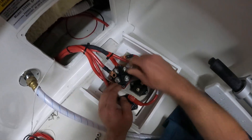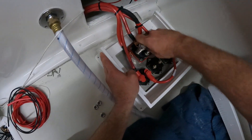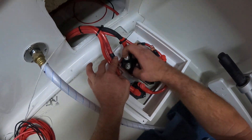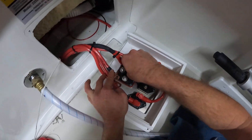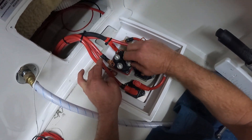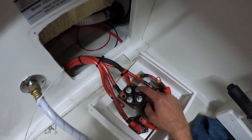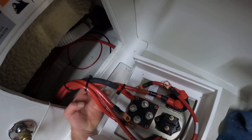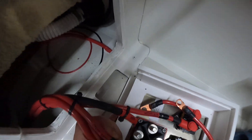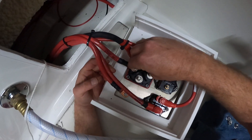Now on the back side again, we're going to loosen up all our nuts. We've got one and one and two and two. Sometimes you might want to put a little marker on there to help yourself out. I'm going to put the batteries on the bottom and the loads on the top, the way everything's falling here. So we're going to put the start battery on post one.